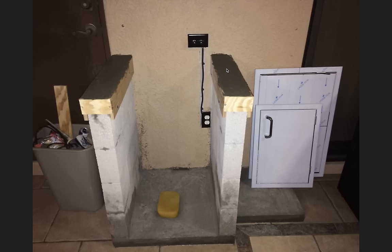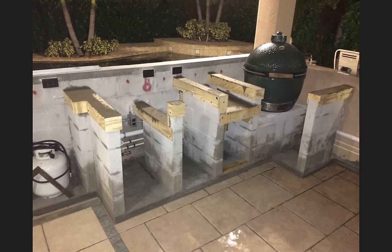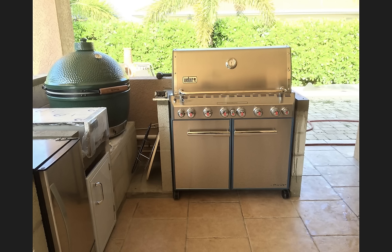Here we're pouring all the caps — that was a mess of a project. I had to wash everything out. It got concrete all over the place, but once it cured up it was good. I did it at night to prevent any cracking and slow down the cure. Everything looks perfect. However, this whole area back here is off because my level was crooked. I went from that silver piece of junk level to a brand new yellow level — that was after I realized that everything was slightly crooked.